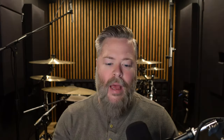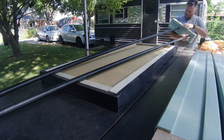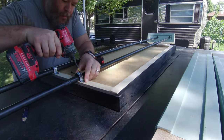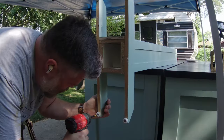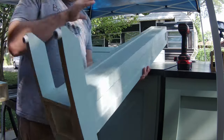I moved on to the sign mount. I attached the poles to the top support to give me the spacing I needed on the backside of the sign, ran that across the back of the sign, and attached the conduit to the backside with wall brackets so it would be held up. Then I put stops on the inside of the topper so it would hold the poles in place so they couldn't pull out, but there'd still be a little bit of flex. I added some pads to the feet for grip and stability since the ground wouldn't necessarily be flat, and I made some little shims to level it out — which we ended up not needing.